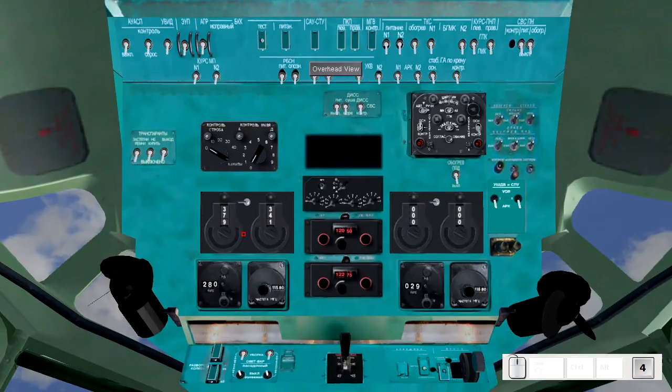Next, we'll go to the overhead panel and start turning on power for the different instruments and systems. Start with the angle of attack and g-meter. Power for the electrical altimeter. Power for the turn coordinator and standby horizon. Power for the vertical gyro system. Power for the reference vertical gyro and main vertical gyro. Power for the main and reserve gyro compass system. Power for the first and second gyro magnetic heading units of the compass system. Power for the static pressure system. Power for the nav radios.